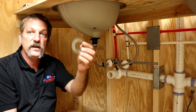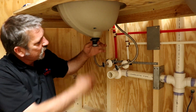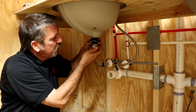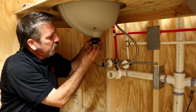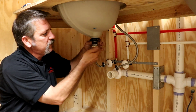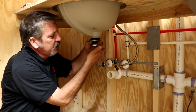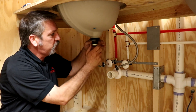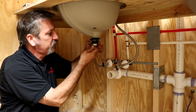You get the grommet on there, then get your big metal flat washer and that goes up on there. You can look at it to see if it's straight up and down, then put your metal nut on. Sometimes this can be tricky — somebody did put some Teflon tape here so it's going to give me a hard time. Normally this would just spin really easy, and once I get past the Teflon part it should just start spinning.